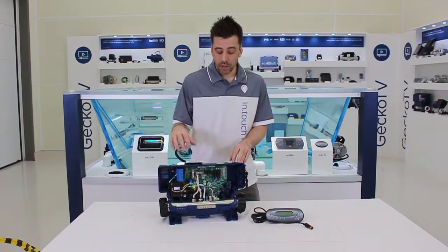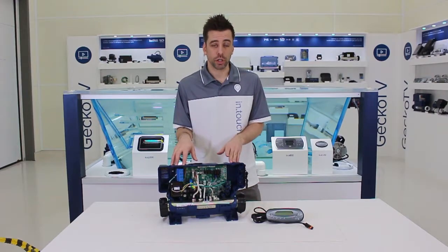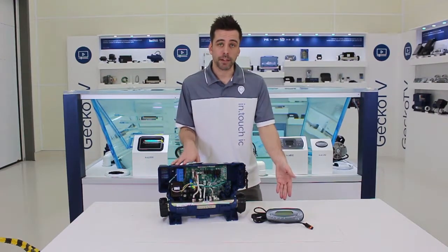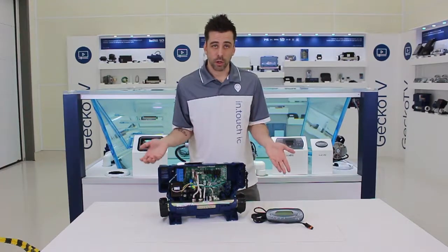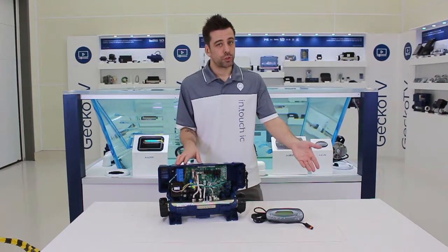The reason is the relays are fed low voltage by the transformer. So if your transformer is good, it should also supply your keypad with low voltage. If your system still operates normally, then your transformer is good and your keypad should be as well — change the keypad.